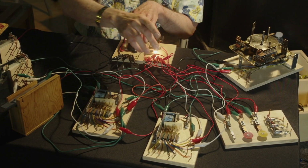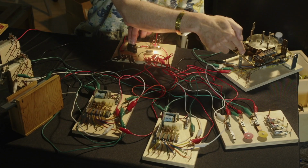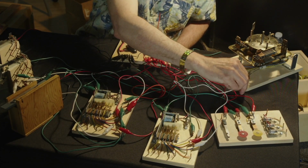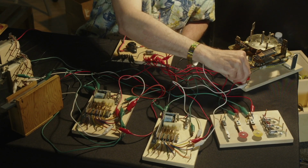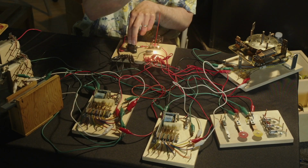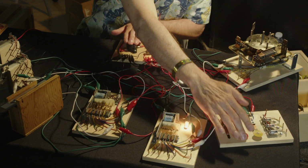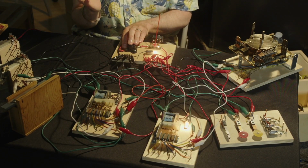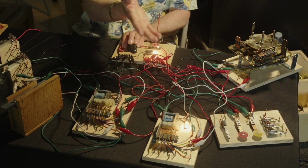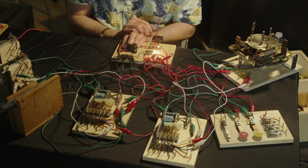The first step, I think, is to move this end of stroke switch that I used manually, put that on the motor, okay? I'm just going to move this switch over to here. So if I've done this right, this relay should now stay active for one cycle through the motor sequence, and then the motor should tell it you're done. Let's see if that's working for me. Okay, so the motor cut the power, but this is typical of 50 points or extra ball, whatever. The motor is the guy that lets go of your relay, okay?